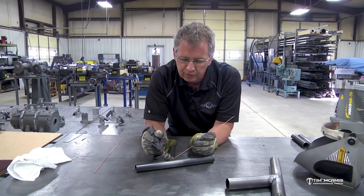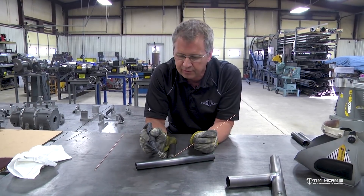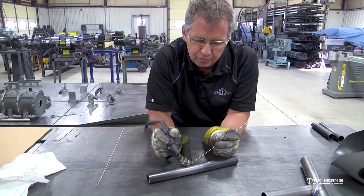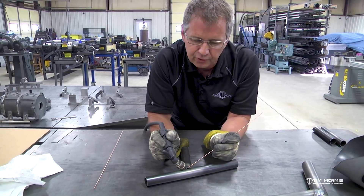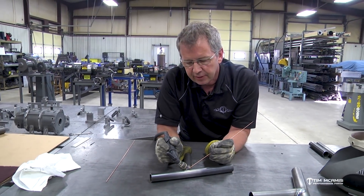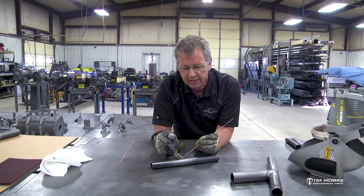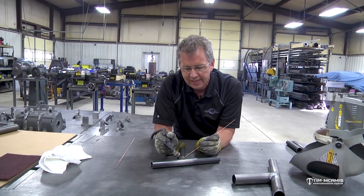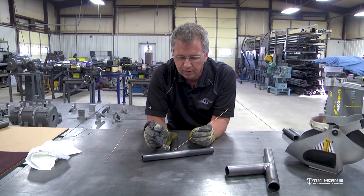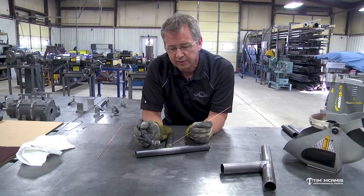As you're coming on this corner here, you've still got a gap, and remember this is getting thinner here — this is thinner than it is over here. So you've got to pay attention to that so that you drag that bead back in there and penetrate that tube, then drag it back over to your base tube and make sure that you're not too cold along here. Get good penetration on that base tubing because it's easy to get a cold weld to stand up on top and fill the gap, but you've got to have penetration. When you get back over to this side where you've got no edge to deal with, go ahead and give it a little pedal and get that weld burned in there. You can see this one has a nice big area that it's attached to — that's basically the essentials on how to fill a larger gap.